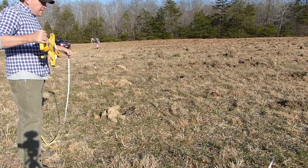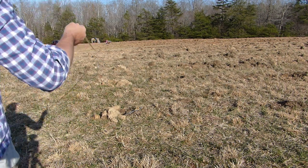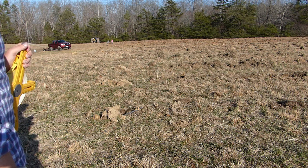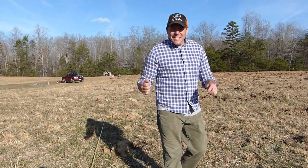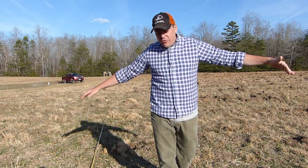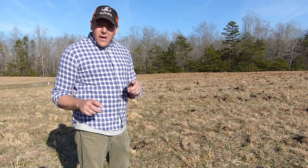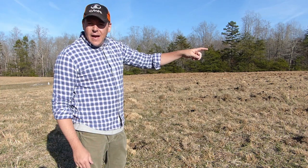We're going to take this one down to 160 feet. Pull it tight — tight like we should be pulling against each other. Okay, stick it in the ground. So Hudson is setting his stake way down there, 160 feet in that direction. We already have a stake set 120 feet in that direction. It should be 200 feet in between those two, and then we'll know we've got it square. I'm pretty sure at this point it's not square, and what we'll end up doing is moving that stick either left or right in order to get 200 feet on the hypotenuse of the triangle.